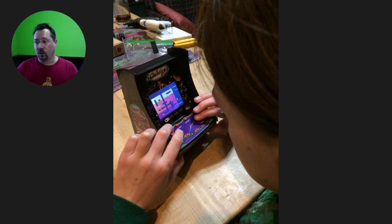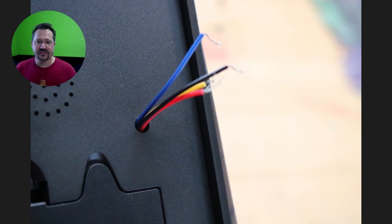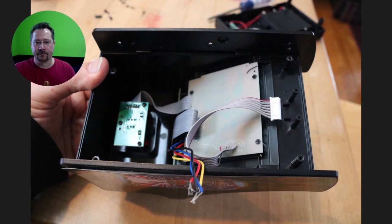The only reason I did that was I didn't have any switches around. We used to have a Radio Shack I could run to and buy a dip switch or whatever I needed, but we don't have those anymore. So instead I would have to mail order some switches and wait for those to show up. Pretty fun though, getting to play Pac-Man on a Galaga machine. Here's the wires just sticking out the back — all I did was drill a very small hole, and then basically just pinch the blue wire to the black wire, or the red wire to the black wire, or whatever combination for whichever game we're looking for.